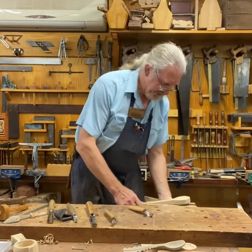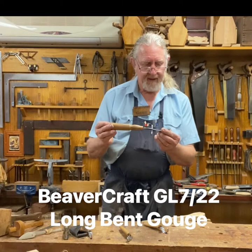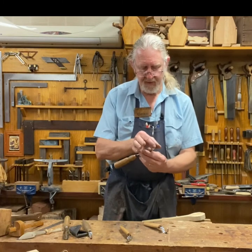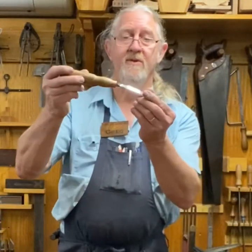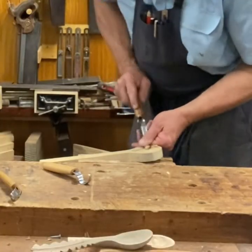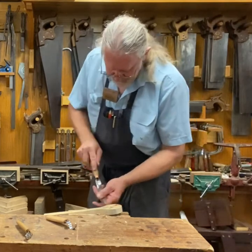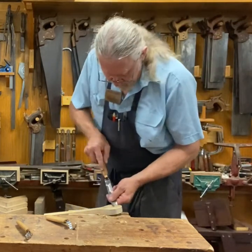I want to show you this — I love doing this with a gouge. We're going to use a gouge in a paring action. This is a long bent Beavercraft one which we're getting with a nice oak handle. We've got a copper ferrule, 22 mils across, and a number seven sweep. It's a really nice tool. With a bit of a bend in it we can use that to get the ball rolling. That paring action — love that sound. This is a really nice way to get it started, and then it's so much easier to come in with the hook knives once you get it going.